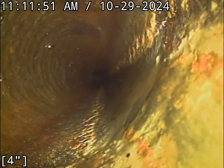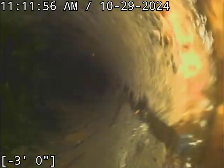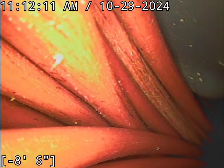We have good flow all the way out to the street. The cast iron here is in very nice condition. There's no rust scale, no pitting, no channeling, nothing. That stuff has held up beautifully. And then everything beyond that is updated pipe, drains off very nice, and a very clean sewer line too. So everything on property here is in good shape and functioning properly at this time. Everything in the road is functioning properly too. There's a little bit more I can nitpick about that pipe, but that's all in city responsibility.